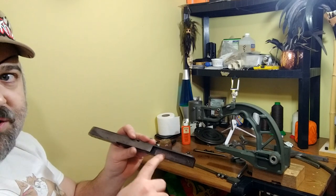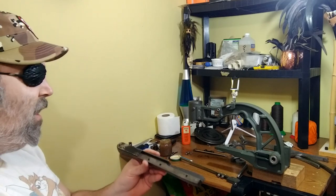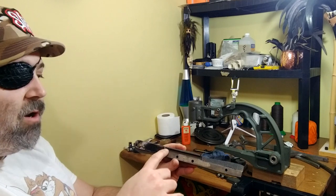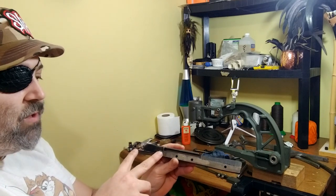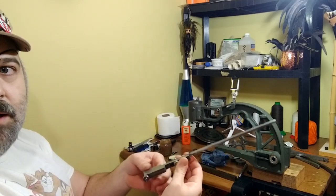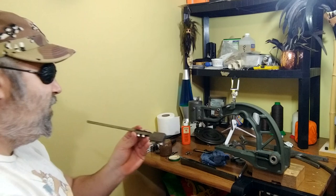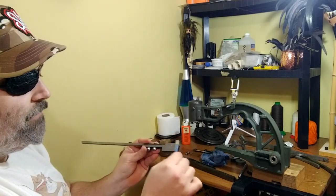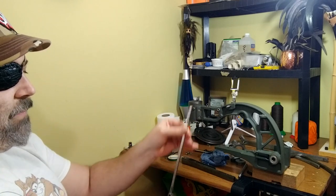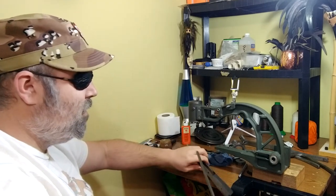Moving on to the actual sewing arm — I did quite a bit of work on the inside of the bobbin well with a Dremel and stone, basically removing any burrs, pitting, or rust inside of there so that when the bobbin and shuttle spin around there's nothing for the thread to catch on. I also removed a little bit of material here because the pitman rod running back and forth was letting the screw heads dig into the metal. You can check on your machine if you notice deep scratches and gouges when you take this off.